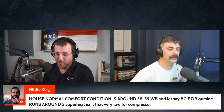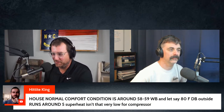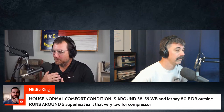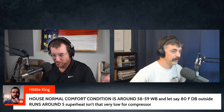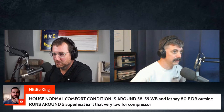Sorry, that's stupid. Okay, house normal condition is around 58 to 59 degrees wet bulb and say 80 Fahrenheit outside dry bulb, and it runs around 5 superheat, that's very low for the compressor. He was asking about piston operation in general, and I think the implication of what he was asking was that the superheat's always the same, which is variable. 58 to 59 wet bulb is rather warm in a house.